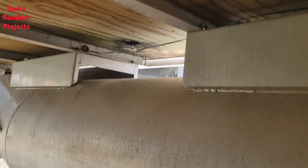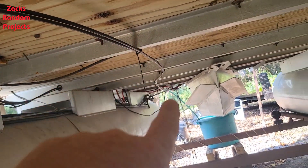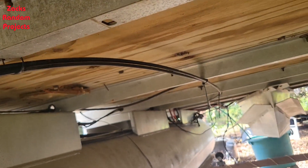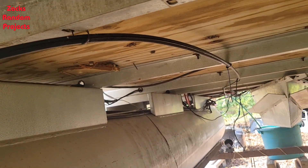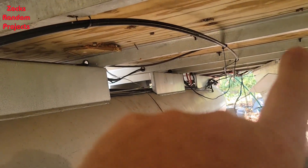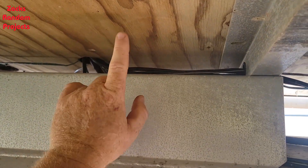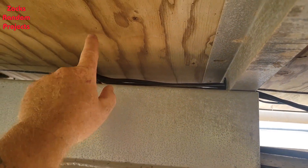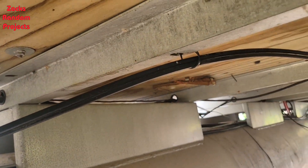All right, here we are under the boat. Here are the throttle cables zip-tied up, going from front to back. I'm going to pull them out, cut all these zip ties, and get these cables laid out on the ground to measure how long they are. That way I'll know how long the new cables I need to order should be — going from the force motor to the controls. I can tell you I'm not going to be able to reuse those Mercury controls; I'm going to have to order a new set.